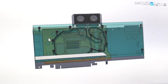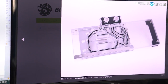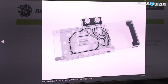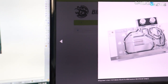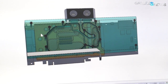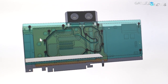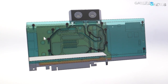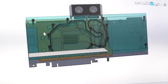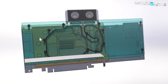Although hesitant at first, we were able to work with BitsPower to show some of the 3D modeling of components prior to production. After taking initial scans of components downstairs using the manual wheel-scrolling and dot-placement solution, the technician sends the coordinates up to the modelers upstairs who begin 3D design in SolidWorks. The company pulled up one of its designs that had already launched, and the models are made to accommodate component clearances and to ensure the right areas on the PCB — like MOSFETs or other power components — are all cleared.